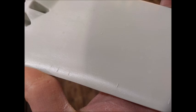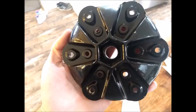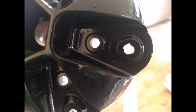It came with six blades and they are all roughly 24 inches long. They are essentially uniform in build and appearance, but I did notice some rather odd marks on the leading edges of the airfoils. I believe they are casting marks, but each blade has them and they are all in slightly different locations. The hub is made of cast aluminum and the casting is pretty rough and dirty. There is a lot of slag glued down with the paint and none of the holes were cleaned out and deburred. It is not a huge issue but it is one that could cut you if you are careless.